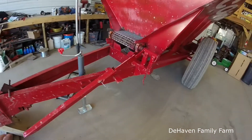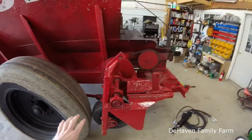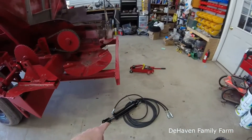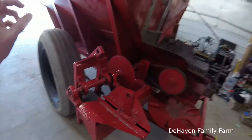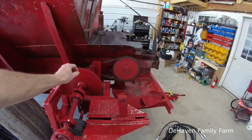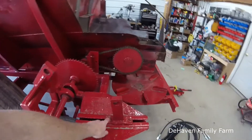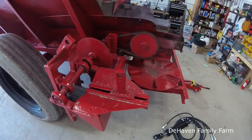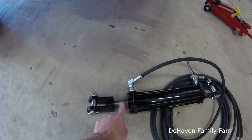All this apparatus for the handle that operates the spreader is coming off because it's ground driven. What I've done is I bought a hydraulic cylinder and a whole bunch of hose because I've got to go all the way to the front. The machine is able to take hydraulics here. My cylinder is about four or five inches longer than it should be, so we'll grind those off and slide the bracket back in the channel. The end is adjustable so we can shorten it enough.